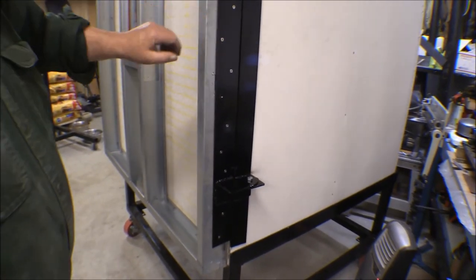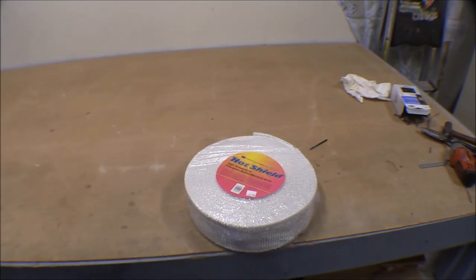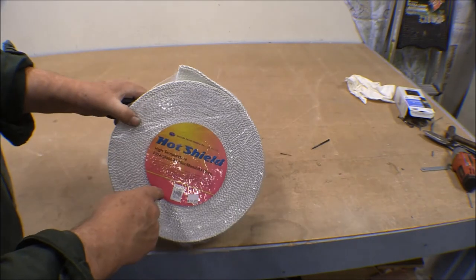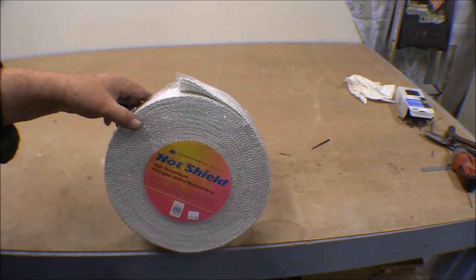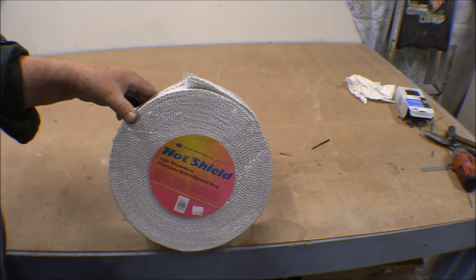Here's what the strap looks like now that it's all painted and put on there — it's holding up pretty good. I'm real happy with how that is. I'm trying to figure out a gasket for the door and there aren't a lot of options around here. I was looking for ceramic or fiberglass tape. The hardware store didn't have any, and the marine shop didn't have anything either — I thought they might since they deal with a lot of boat mufflers. But I went to NAPA and found this roll of high temperature fiberglass tape used for muffler and manifold wrap. That was 60 bucks — less than buying four or five pieces of wood stove door gasket. It's about an eighth of an inch thick, so I think it's going to work.